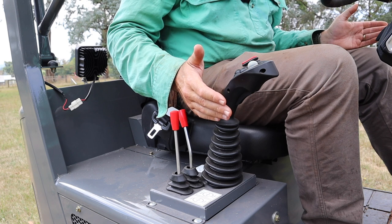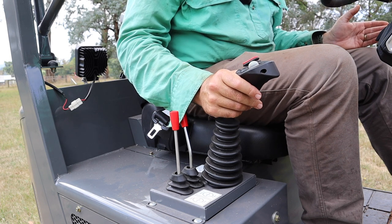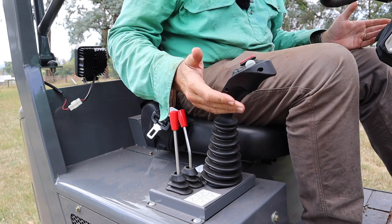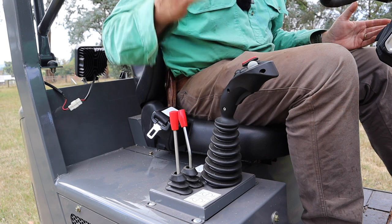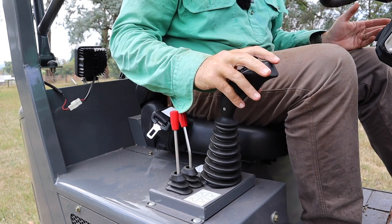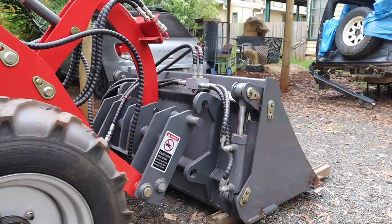Your control lever to your right has multiple functions. First off, there's the forward and reverse control select — there are no gears on this machine, so it's very much like a forklift to operate. Then you have your mast controls: lower, raise, release, and crowd towards you — pretty stock standard stuff. Most of the other controllers are blanked off; I'd love to see a four-in-one bucket control on these, as the four-in-one bucket is controlled with a separate accessory lever, meaning you have to take your hand off the mast controls to operate it. This controller here is your locking pin control, so you can quickly and easily change between your bucket and your forks while sitting in the cab.